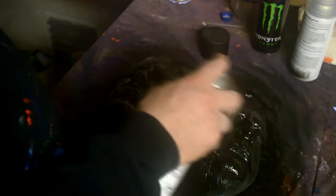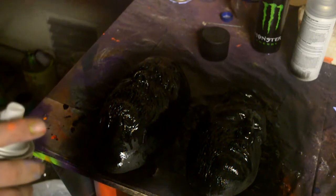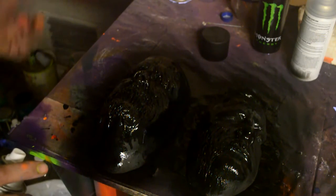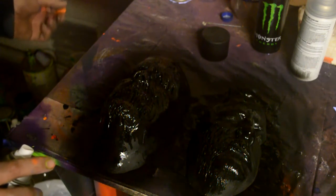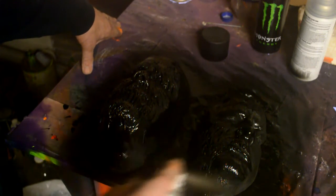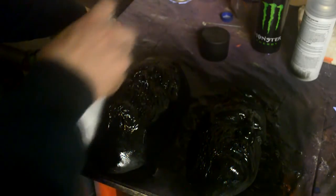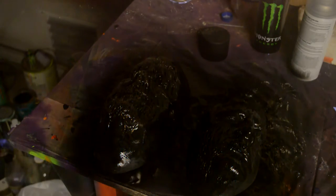I pour these up so they're flat on the bottom so I can flip them right around and be able to pull that way. They last a lot longer — yes, more expensive to do, but the end result is these molds will last for years, especially when you are religious about using your mold release. Just FYI, this works when you're doing plaster or even clay. I've done this with clay as well. We just want to make sure it's a nice clean coat and then clear coat, and then we'll be building the shell for the mold.